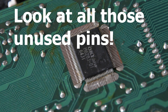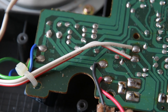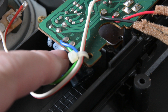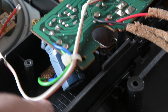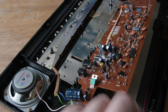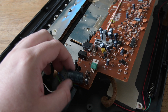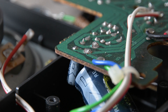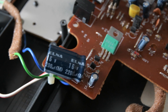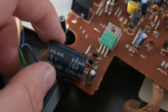On the side there's a bunch of connectors, and looking under here the first thing I notice is this large capacitor is loose. This is part of the power supply — I believe it filters out any noise coming in through the keyboard. This large cap is typical but it shouldn't stop the unit from working if it's not attached; however, I do suspect it's torn the tracks. Testing with the multimeter, there's no connection between each side of the circuit across the connection points to that capacitor.